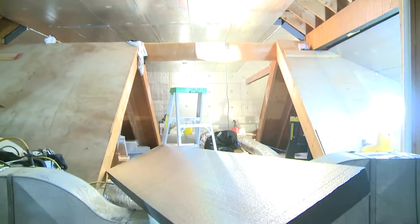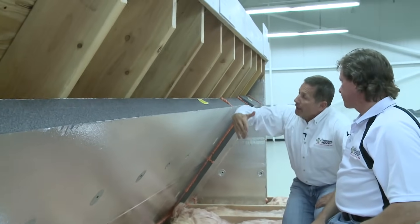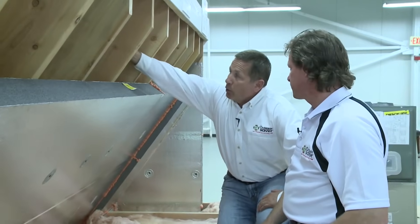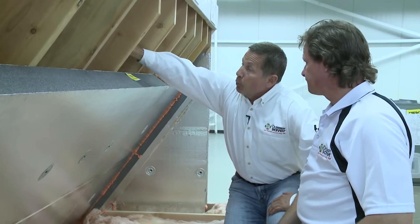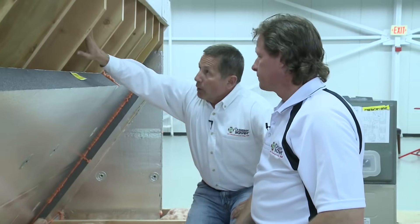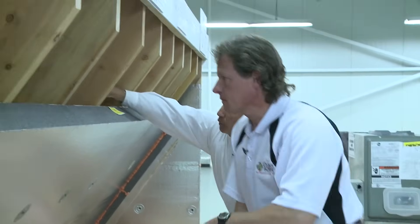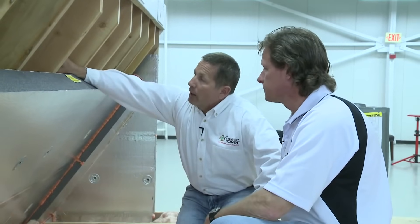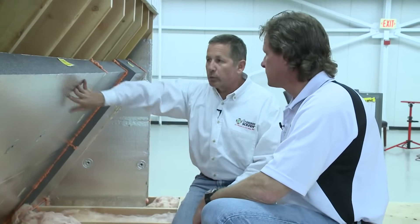And that's very important, because if the roof isn't vented and we don't allow the underside of this roof to stay cold in the winter — and it should warm up somehow — that'll give us those ice dams on the outside, which we don't want. So we want to maintain the airflow behind here, maintain the ventilation that this house was supposed to have, but at the same time create a conditioned space in this attic.